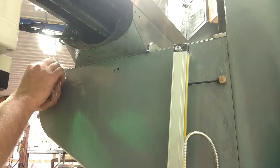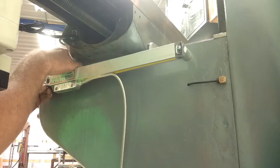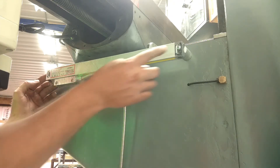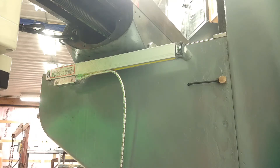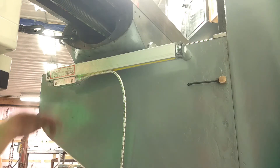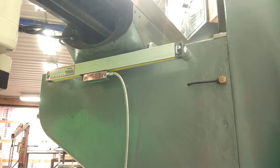Okay, I've got one side up there already. I've got a set screw in the hole. I'm going to drill and tap these aluminum slugs to match it. Now I can just mount that one up there. I don't think they're centered — the holes look pretty close, but I don't think it's quite there. I'm going to get a transfer punch and mark that. Okay, that's mounted on there. I'll cut the shrink wrap off holding the reading head and get an indicator on there to see how straight we are. There's a little plastic clip in there that holds it too — it's best to leave that in until you're done so you don't damage the scale.